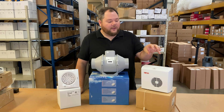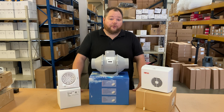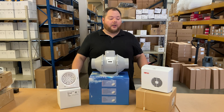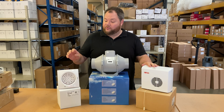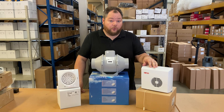But there is one other style of fan to look at, and that is this. This is a centrifugal fan. Now these are useful in a particular instance: if you do not have loft space to be able to have an inline fan but you also don't have an external wall for your bathroom, these fans are ideal. They are either wall or ceiling mounted and are designed to be able to duct over much greater distances than your standard axial fan would, giving the option to be able to reach an external wall.